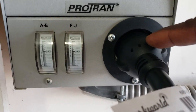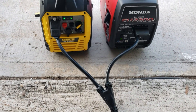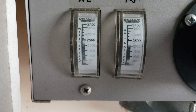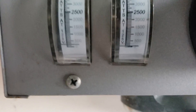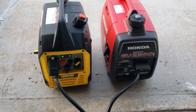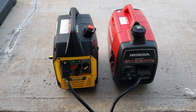So I'll plug this in right here. Come to my generators — you got the Honda and the Champion plugged in together with the Y adapter plug, and that goes right into the transfer switch or your 30 amp inlet box. I heard something come on — yeah, you can see this went up a little bit. So I just turned on some loads. Now you can see the generator carrying whatever load I turned on. I turned on my refrigerator, the master bedroom, the living room, and the kitchen — and they're both running independently.